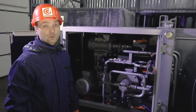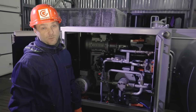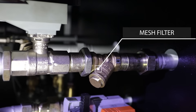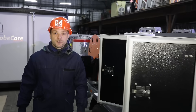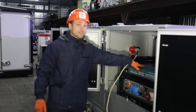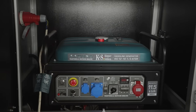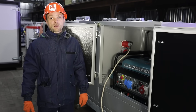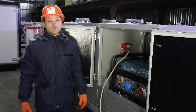Both the unit pumps and the wind turbine gearbox are protected from the destructive effects of solid particles that may be contained in fresh oil. Before entering the pumps, the oil passes through a filter with a filtration fineness of 500 microns, and before pumping into the gearbox, through two filters with filtration fineness of 25 and 3 microns.